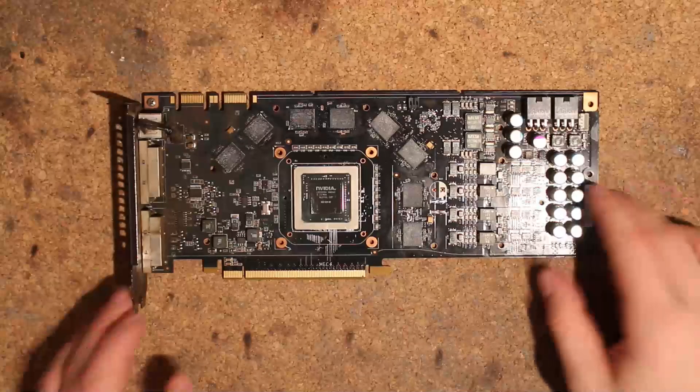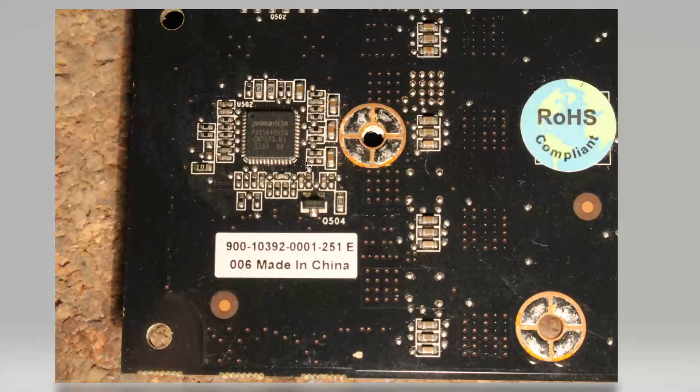Now let's move to the computer and do a quick overview of the volt mod. Let's start with vGPU. The feedback pin should be pin 6 in — right here. But you can grab it way easier at this probe point here between those two caps — that's what I would recommend. From there, the usual stuff: a variable resistor to ground. For ground points in the area you can use the screw holes or the entire left side of these capacitor banks.